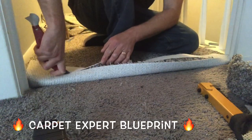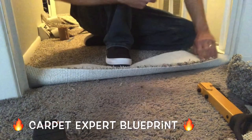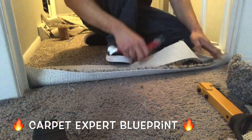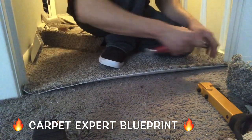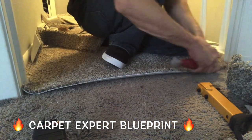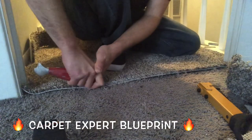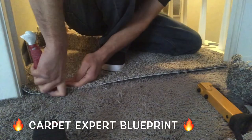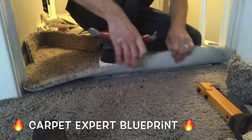Now, if you don't have a steady hand, I want you to mark the sides of the door jamb on the new carpet where you want the seam to fall, and then put a straight edge on it from point to point, and run that down it. That way you know you have a nice straight edge — it's going to be clean, beautiful, and good to go. In this case, I'm just tracing the new carpet with my razor. Make sure you have a very sharp blade when you do this, otherwise it'll just shred and look horrific.